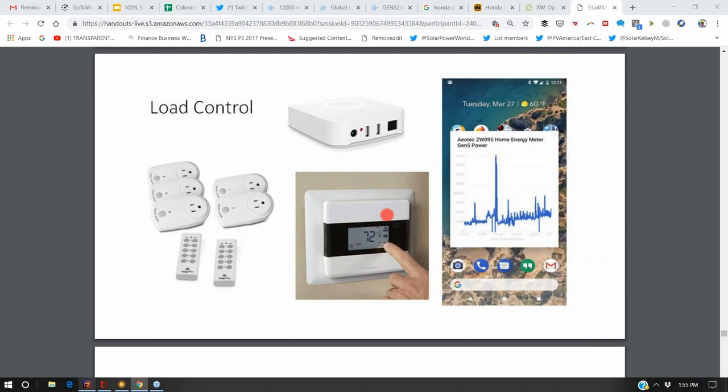So, what's kind of interesting about this next upcoming project is we have a large house and a 12 kilowatt inverter, and the home, based on historic energy usage of their old house, should not exceed 12 kilowatts. But there's so many breakers in this house that the concern is, yeah, but what if they're using their hot tub and the electric sauna, and everybody's home watching television in different rooms?